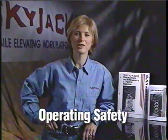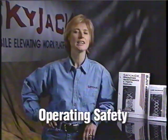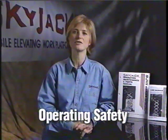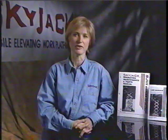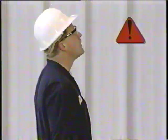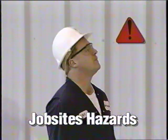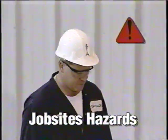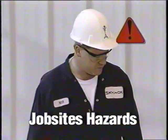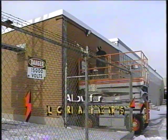Once you've become familiar with the rules, regulations, and operating instructions of your model, it is time to discuss some of the hazards to avoid when operating any type of aerial work platform. Before beginning to use any aerial device, qualified operators identify hazards or dangers that may be present. This is usually done by performing a thorough site inspection before actually using the equipment. SkyJack aerial work platforms are not insulated.